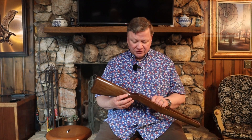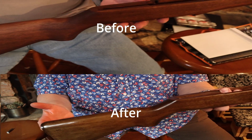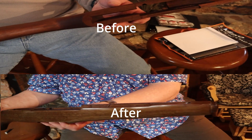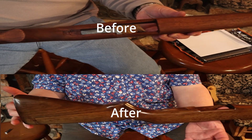So I did it again with the same true oil finish, but a little bit different this time. When I was putting the coats on there, I would stay out there with it. And if it had started to run at all, I would take the steel wool or whatever I was applying it with and smooth those runs back out so that it would dry more evenly. I'd wait about 30 to 40 minutes, then go back out to the shop — it had started to sag — so I'd spread it back out again. Had to do that two or three times before I let it dry overnight to get the finish exactly like I wanted it.